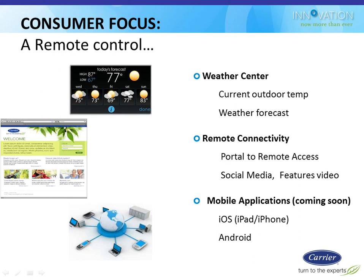So a couple other questions that popped up. Vance asks if you need an outdoor air sensor or will it defer to the Wi-Fi weather. I don't know the answer to that question. He specifically writes, do you need, in bold letters, if you have to have it. I'm going to say, yes, you have to have it. I would not rely on the internet connection to pull weather data through and use that to decide if my heat pump's going to go into defrost or my humidifier is going to ramp up. So I'm going to say, yes, you have to put the outside air sensor in. Whether that's technically true or just a smart true, I'm not sure.